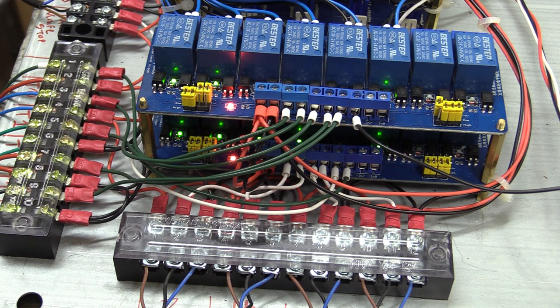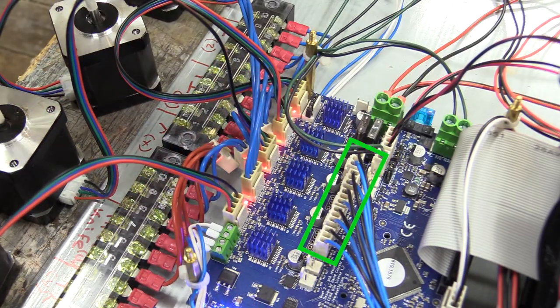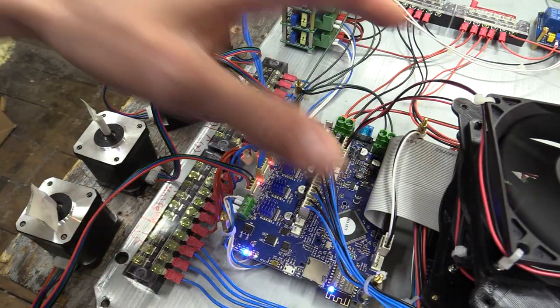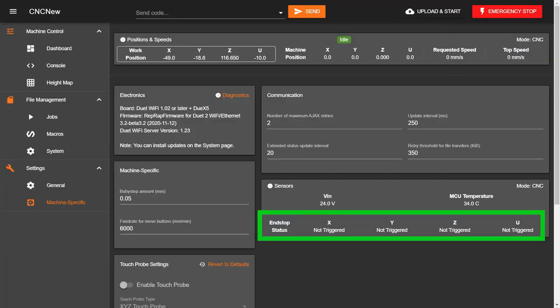The relays are held in an energized state while powered, and those also go out when the proximity sensors are triggered. The pins from the controller for the different axes are wired via the normally open and common relay terminals, which, when everything is powered, is closed. In essence, at all three points, when the sensor is not triggered, the lights remain on, and when they are triggered, the lights turn off.